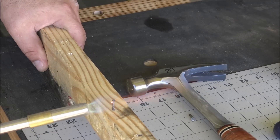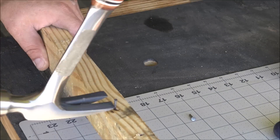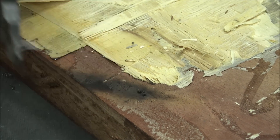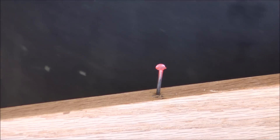Now upcycling pallets can be kind of a pain, but when you've done all the work, pulled all the nails out, and you've got that one stubborn nail left that doesn't want to come out — just add a little heat to it, a propane torch or some sort of high heat, let it cool down for a few seconds and it'll come right out. Works on staples and the ever stubborn nails in oak as well.